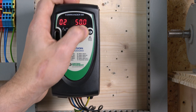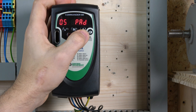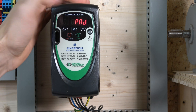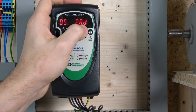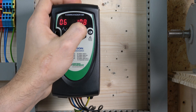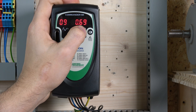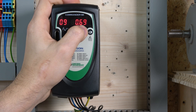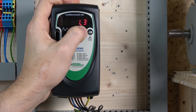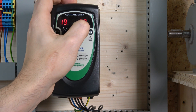Now let's go through the key commissioning parameters. First enter the minimum and maximum frequency, then acceleration time in parameter 04. For control mode, we're selecting PAD — keypad control. Then enter the motor nameplate data: amps, RPM, voltage in the relevant parameters, and power factor in parameter 09. All of this should be on your motor nameplate. After that, change the access level to Level 3 so we can run the auto-tune.